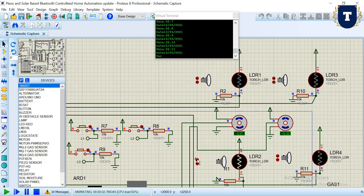The servo motor is rotating anti-clockwise, and if I decrease the sunlight it will turn off. Again, if I increase the sunlight on the other LDR, the servo motor turns clockwise. This part is used for the horizontal movement of the solar panel.